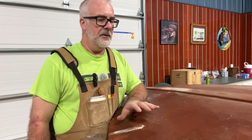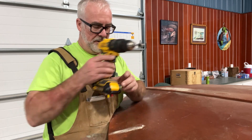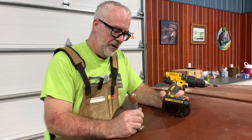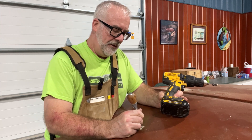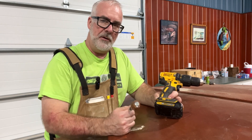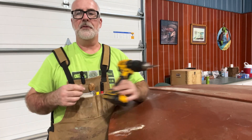I'm going to go ahead and do all of these, and then I go back with my pick and gently go around it, because I'm trying to preserve that wood and I don't want to make that hole ragged. Then I'll hit it with a vacuum and clean that out, and then just pick away, always thinking about keeping that perimeter on the very top layer nice and round.